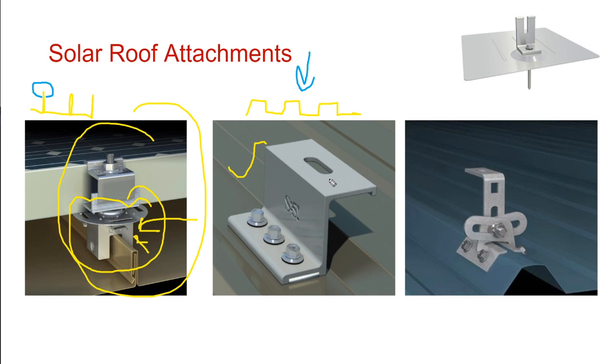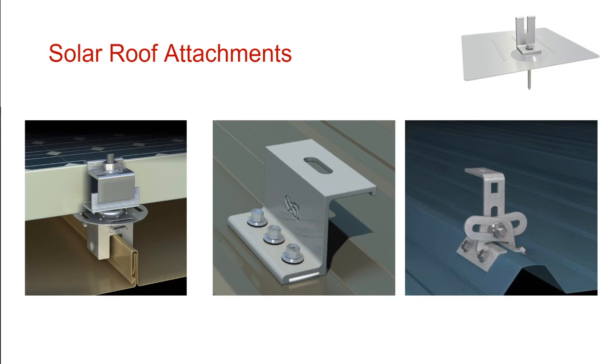What happens in solar is when you're up on the rooftop and you're drilling these screws into the rooftop and you're like, wow, I'm really drilling a whole bunch of holes in the roof. You're there with your power tool. You can kind of get a feel for if that screw is solidly going into the roof or not. And you're right up there making every attachment point. So if you're doing your job right, it doesn't cause leaks.